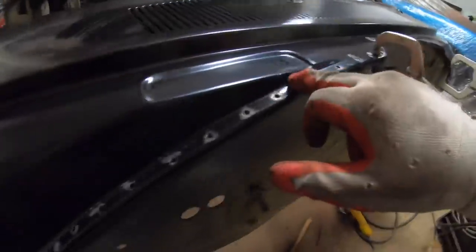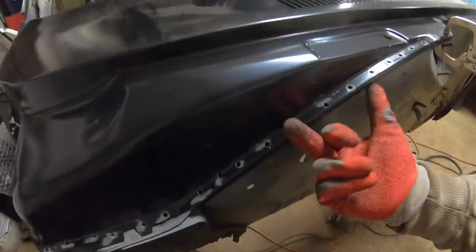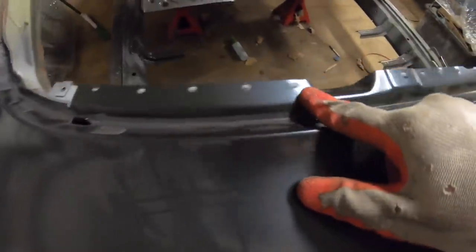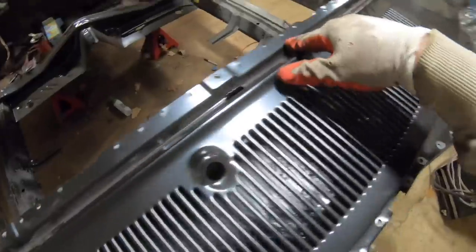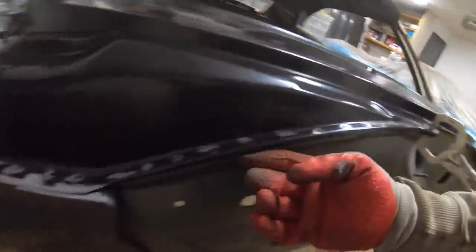You can see here, I drilled all of these holes all the way around here. Then I have to go back through, deburr the top, deburr the bottom, and it just takes a lot of time. With that punch flange tool, all you do is knock out all these holes all the way around. And they're really nice. You don't have to do any deburring. They're perfect. So definitely saves you a lot of time. But with this flange here across the bottom, I couldn't really do that.